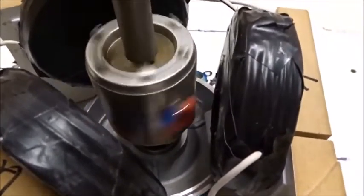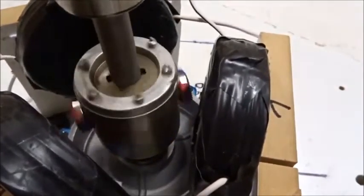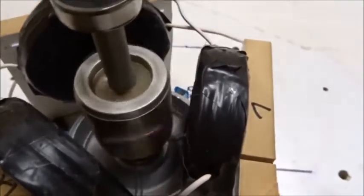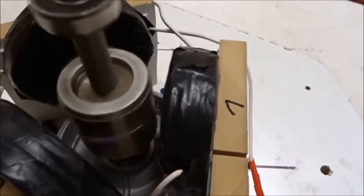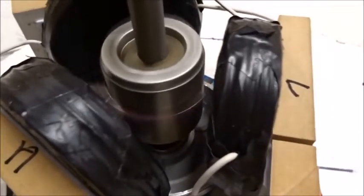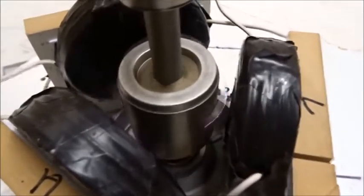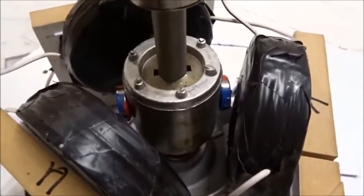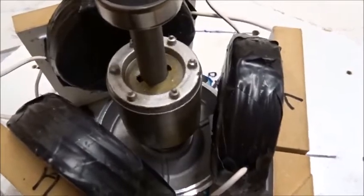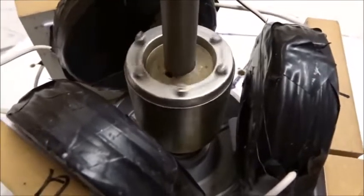We just have two magnets like a bar magnet — two little ones on each side of the center, blue-red — and it's spinning at one hertz. The iron wouldn't do anything here. So we just spin this thing up. By 10 hertz we'll have the combined torque of magnets and iron together. It's really flying along quite nicely now at 10 hertz. That's just two little magnets. Now I'll show you what it looks like with the magnets removed. This is exactly the same thing with the magnets removed — all it does is start really slowly. How long is it going to take? Like my lawn mower.